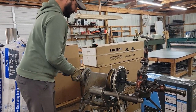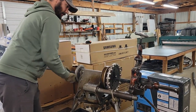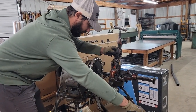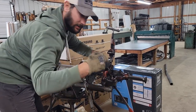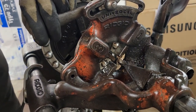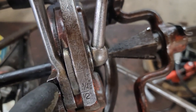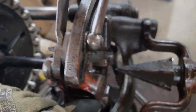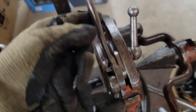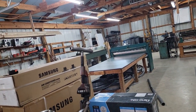Take and open this up here, I'm going to slide the gas pipe in and close it back down. Now we're going to take and use our die and thread this gas pipe. We've got this handle here, we've closed this down and butted it up to the pipe. You can see right here on this die it shows me half inch, and I've got my mark lined up, so we're ready to use this die to thread this pipe. Close it in and bring it up.